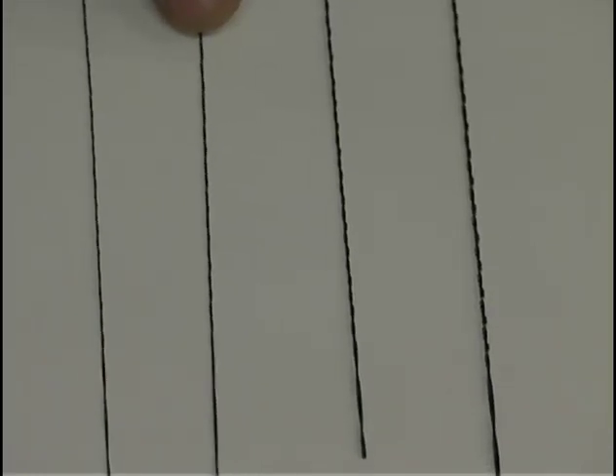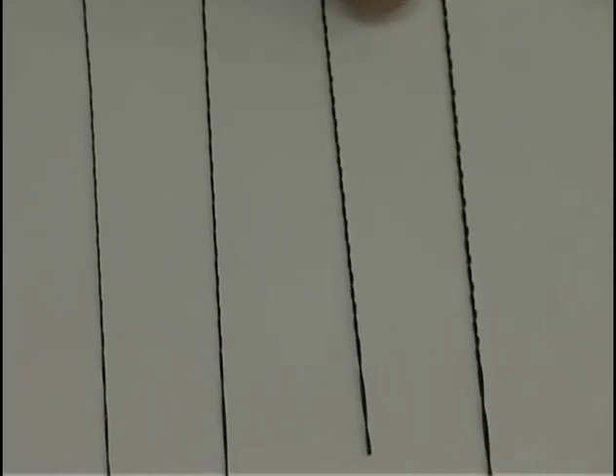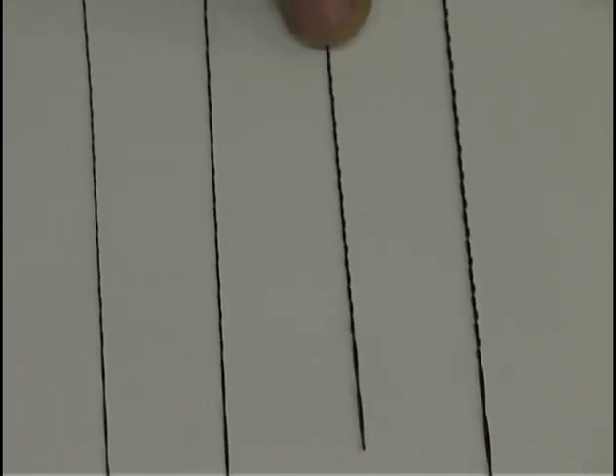The second blade is a number one spiral blade — 45 teeth per inch and 27 thousandths of an inch in diameter. As you can see, the blades generally get larger in diameter. I also use a number three and a number five. These are the four primary blades I use to produce all my cutting.